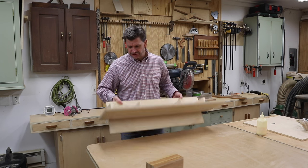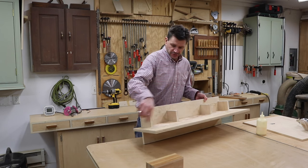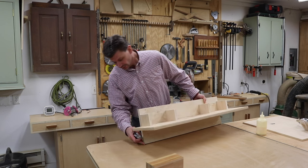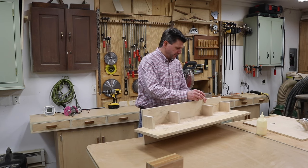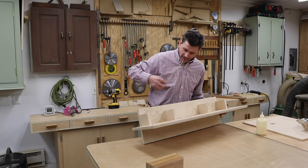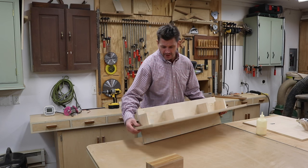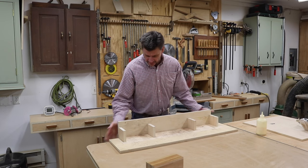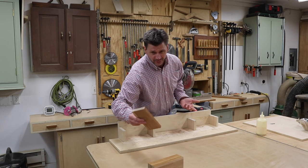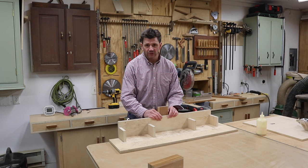If you want to make this jig, it's one piece of plywood in the back measuring 10 inches by 39 inches, and another piece that's 10 inches by 33 inches. There are a couple of braces to keep it nice and straight — those are three and a quarter by four inches. This just clamps to your table and gives you something to clamp your workpiece to, which is important when cutting dovetails because you need to hold the piece in the vertical direction.